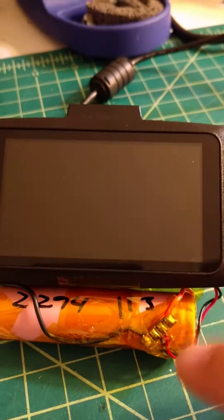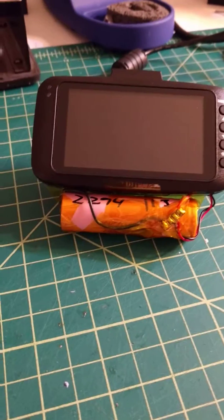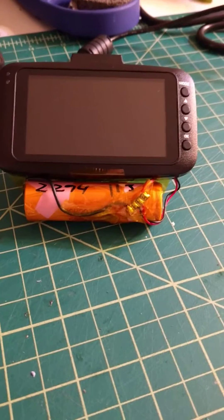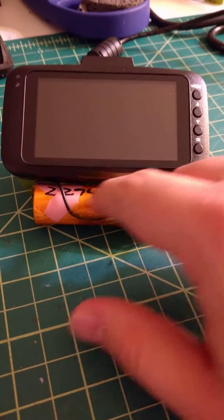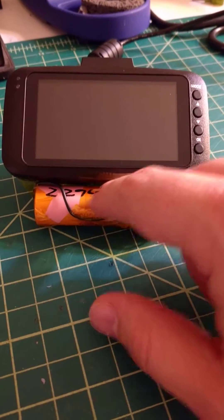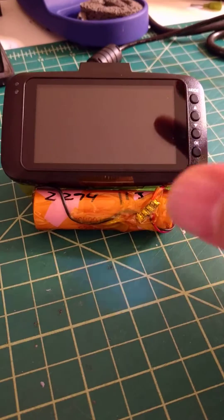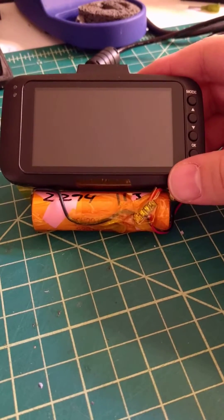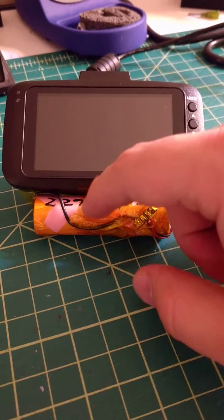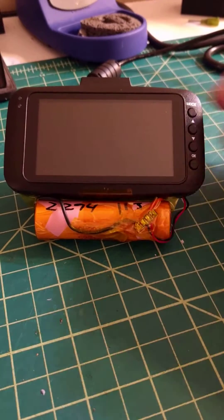This battery is about 2.2 amp hours, and I looked at the amount of amperage that this little dash cam uses when it's shutting down — it's only about 300 milliamps. Being in a hot car will obviously damage this battery, but with the charge controller and how little current the camera pulls out of this battery, it should last a long time.